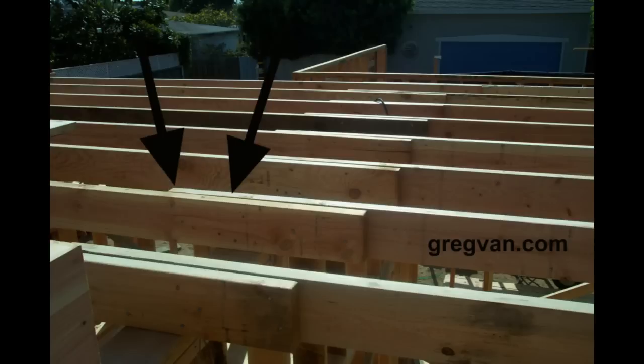Make sure that you check with your architect or structural engineer for more information. The last thing you would want to do is not have these laps long enough and then be ripping the ceiling out — so this is important. A lot of times things like these are what kill home builders because they don't understand what they're for. Hopefully you guys have a better understanding now of what these ceiling joist laps and connections actually do — they hold the outside walls together, keep them from spreading apart and falling down.